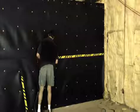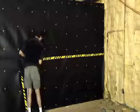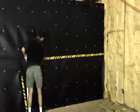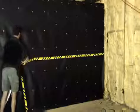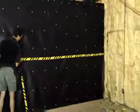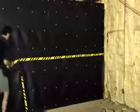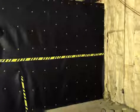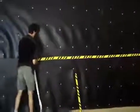Due to our unique formula of Acoustiblok material, common construction tapes and adhesives will not last over the lifespan of your assembly. This is an important facet of an acoustical barrier within the wall assembly. The accumulation of openings from lack of adhesion could constitute as much as 10 to 12% of a reduction in your perceived STC value. So make sure you have enough Acoustigrip tape on hand and do not substitute it with other construction tapes or adhesives.